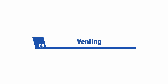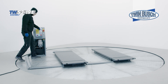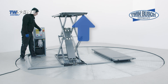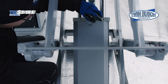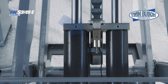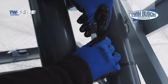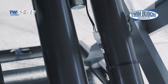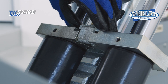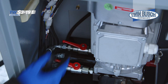To vent your TW S3-19E, check that the light barrier for synchronization is switched off and raise the lift to about three-quarters position. Make sure that you do not raise the lift as far as the limit switch. Now you can remove the locking magnets, otherwise these can be damaged by continuous load during the venting process. To do this, unscrew the cylinder cover. Here you will find the locking magnet, which is secured with four screws. Disconnect the plug and then loosen the four screws to remove the locking magnet. Also remove the safety catch. By opening the two valves and pressing the down one button, you can now lower the platform again.